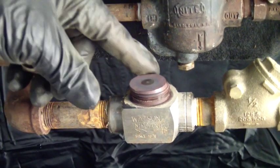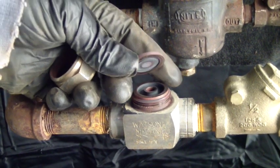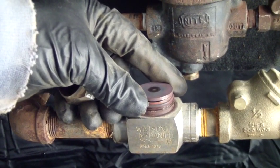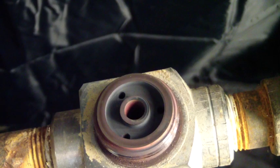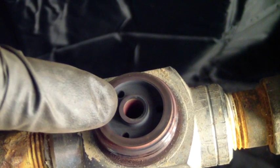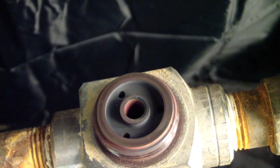The disc simply lays on the valve body. The pressure of the steam system pushes the disc up, allowing condensate to flow to the outlet port. The center orifice is where the steam enters the trap body. It is this surface that seals with the disc to stop steam from passing. The two smaller openings in the cavity are the outlet from the trap. Ensure these are clean and free of any restriction.